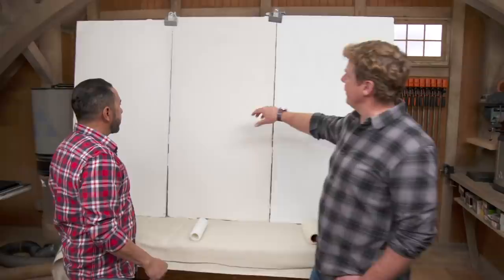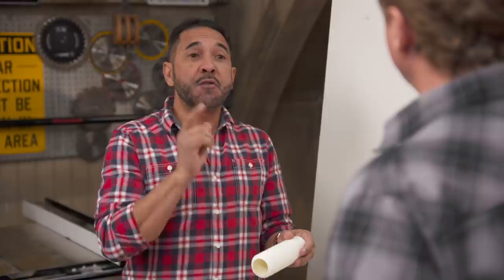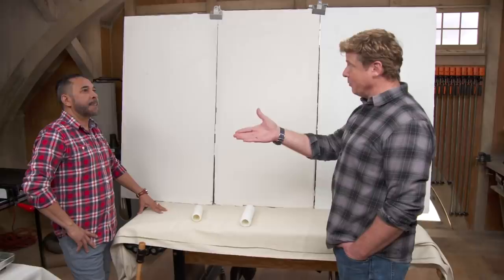When you go to the store, look for the label — it will tell you how thick the nap is and what kind of surface it's good for. So this label would say quarter-inch nap for smooth surfaces. Now, for technique: let's start with the three-eighths on this semi-rough surface. Roller cover on the actual roller, paint is poured in the tray, and we'll saturate the roller enough for the first pass.